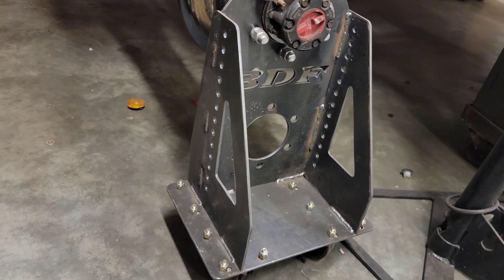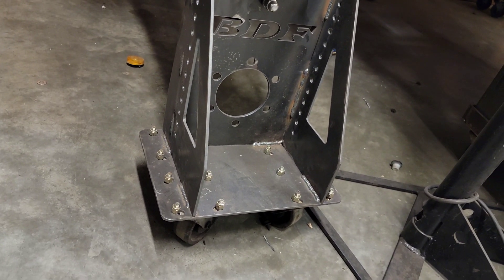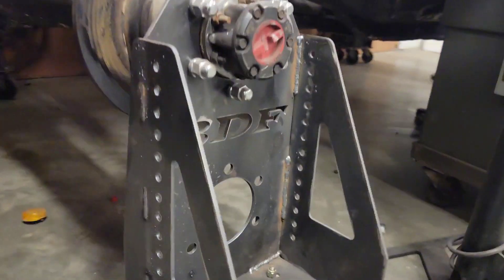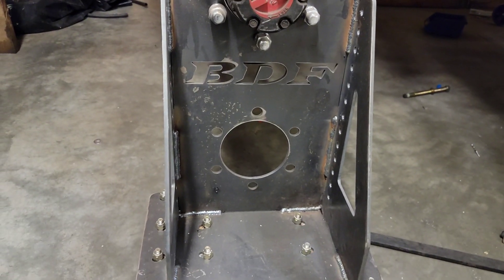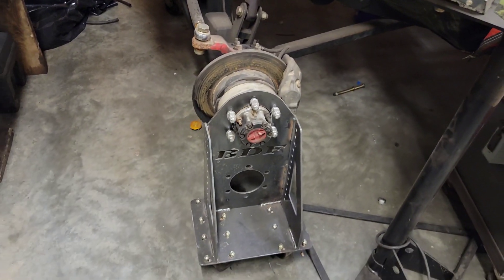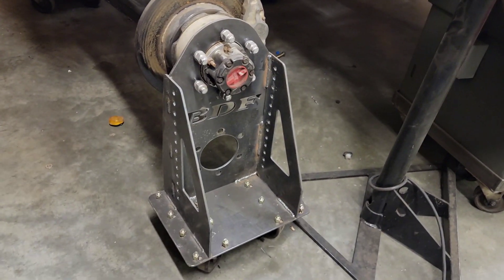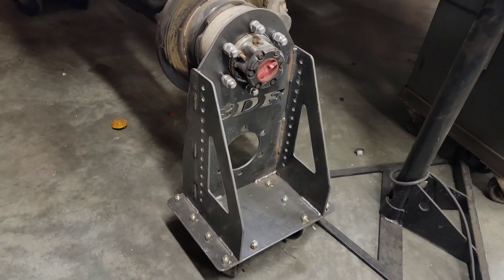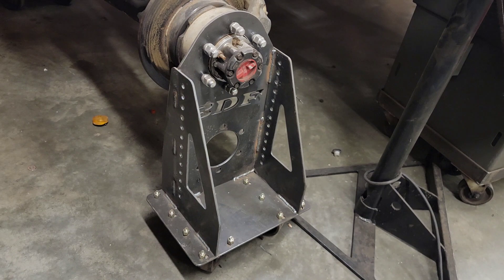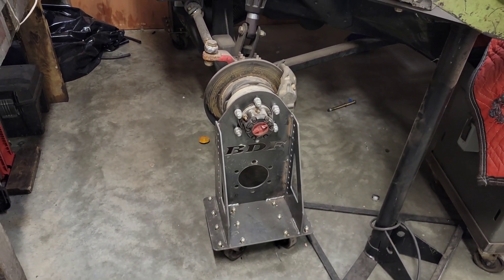Once you've got access to a table, whether it's yours or somebody else's, it just opens doors. Like these axle stands — they're a game changer. Non-directional casters on the bottom, bolt onto the wheel. We even put bolt holes here so on a solid axle you could put a crossbar on and bolt things there. You've got a tray for parts, you could set it at ride height or set it way down on the floor, and you can spin this whole truck around with one hand on a nice smooth concrete floor. This is something we put together for Dustin's truck. It doesn't matter if it's a hot rod or a four-wheel drive — you can build them for different bolt patterns and different heights.